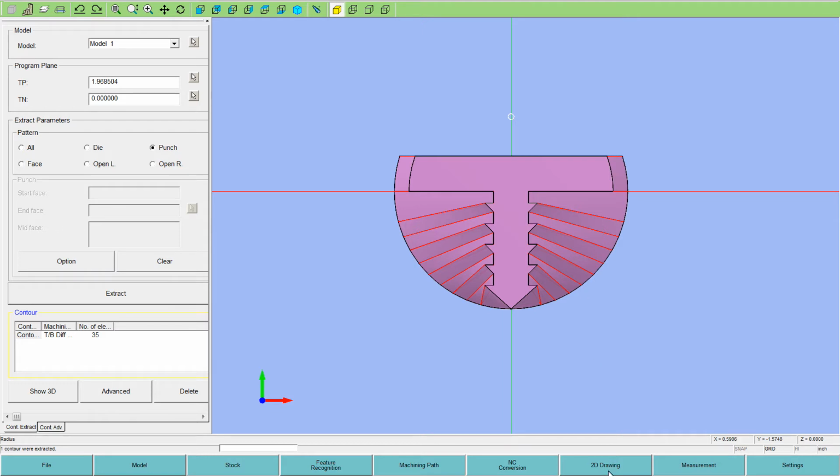Now, if you're doing a die with multi-holes, multi-pockets in it, it has a function to search the entire block. There's a starting hole search function. So if you have little circles drawn in for your start holes, it'll search for those. And you would go in here and tell it what the max size is for your start holes, and it'll search all your circles. And if they're within that size, it will change them, instead of cutting circles, into wire starts.